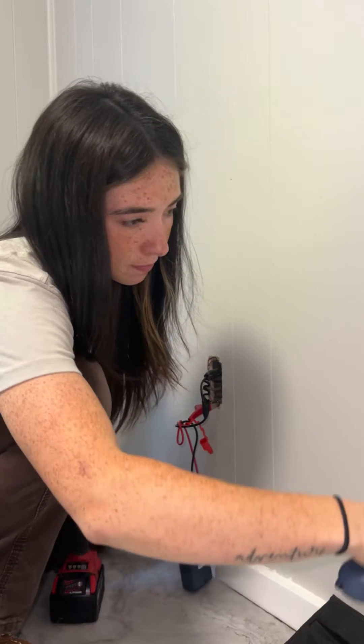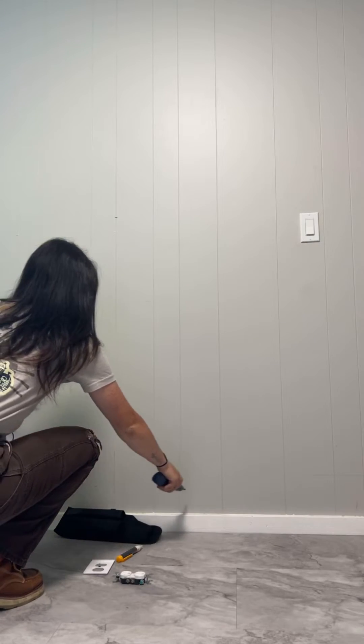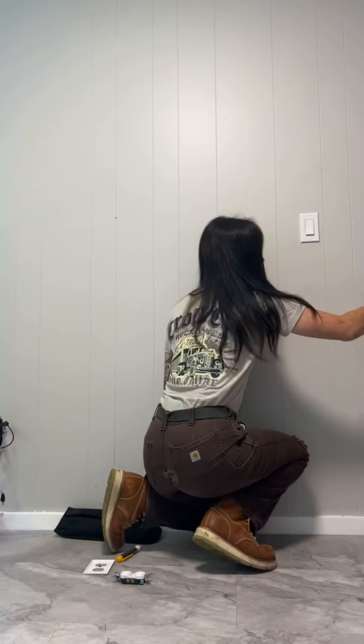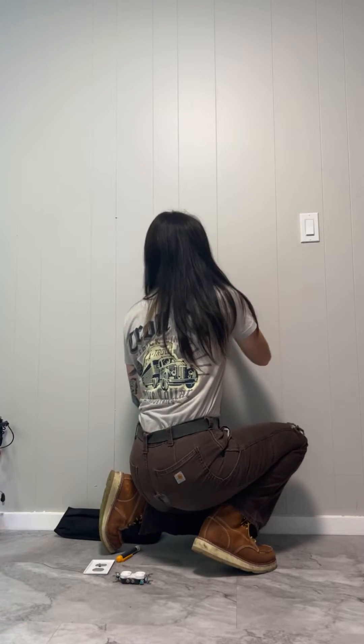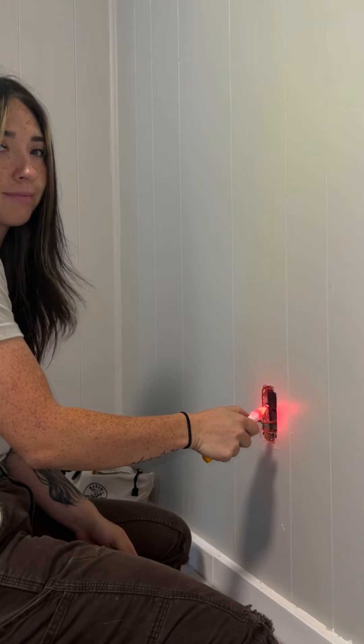Once you're hooked up to the prongs, you want to do a zigzag motion up and down and all around your area. I noticed the most noise down under me, which means it was probably somewhere in the basement. I checked all my devices just to see if it was fed off any of them, but I found this junction box. The hot wire was completely disintegrated since it was an old wire and it wasn't even attached anymore. So I reattached and re-spliced everything, and there you go.